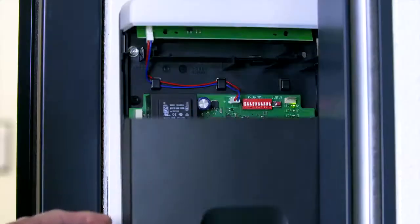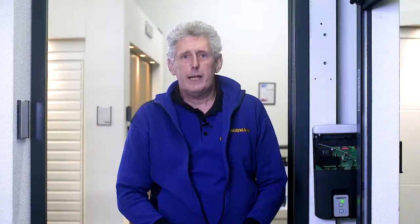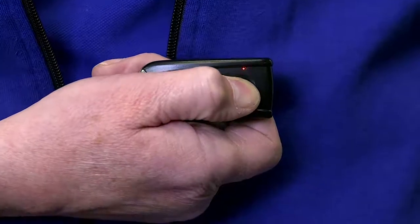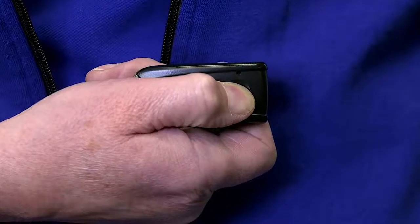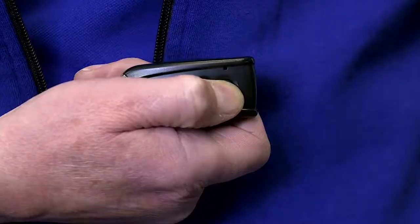We're now going to program the 433 megahertz transmitter. Please note this should only be done by a competent person as removing the cover will expose the mains voltage connections. Firstly remove the cover. You'll see a button marked learning and an LED marked number 3. Press and release the learning button. LED 3 will start to flash. Then press and hold the button on the handset. LED 3 will increase in flash rate. Release the handset button, then press and hold the handset button again until LED 3 flashes even faster. Release the button on the handset and wait for the flashing to stop. The handset is now fully operational.